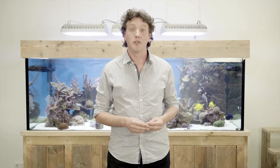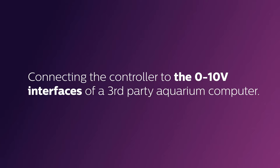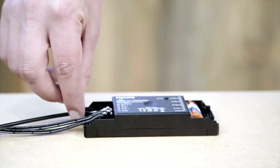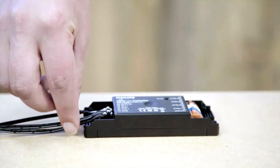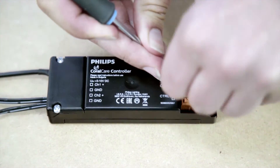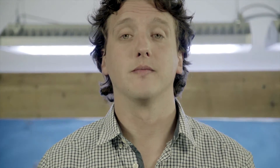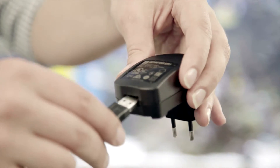Ideally, install the controller in a well-ventilated area. Then decide which mode you want to use — there are two options: the PC scheduler option and the 0 to 10 volt interface option. To connect via the 0 to 10 volt interface, connect the USB cable and a double 0 to 10 volt interface cable from a third-party device, then close the cover using the screws. Connect the communication wires from the fixture to the controller, making sure you connect the two wire leads to the same colour group. Close the cover. The controller comes preset in 0 to 10 volt mode. The USB cable can be plugged directly into the adapter, and you're ready to use the system as soon as you've powered up the fixtures.